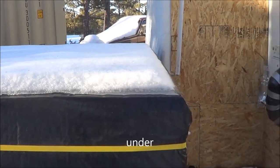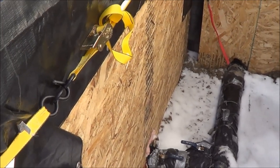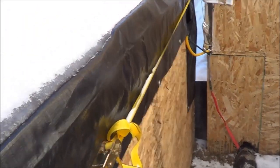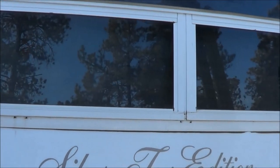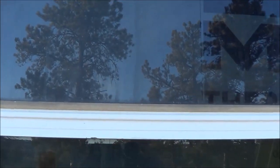There's a heat lamp back there in the corner and another heat lamp up there as well. There's the insulated wrapped-up water pipe with heat tape on it — heat tape on that pipe too, going up into there. Inside, on the windows, I've bolted up foam board on the inside of the window frames to seal the cold air from seeping through, because there's a beauty ring all around the inside.